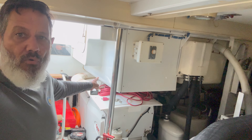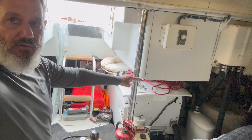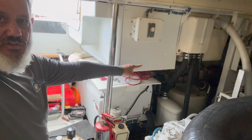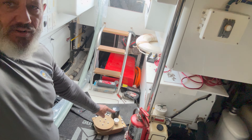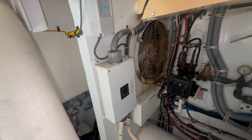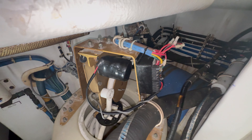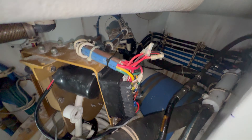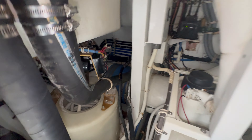We're back on board and dealing with the port side shore power cable. We have our new CM7 unit and our relay right over there — that's going to be replacing the electronic relay box. We're replacing this unit here, as this one was completely worn out with stripped threads and broken teeth inside. We've installed the new CM7, replaced the relay, adjusted the shims, and tested it in and out. We got our new 6-3 connected to the main breaker, secured in the best fashion, with the roller guides in place. You can see the whole unit inside the bucket — 85 feet — and there's the port side.